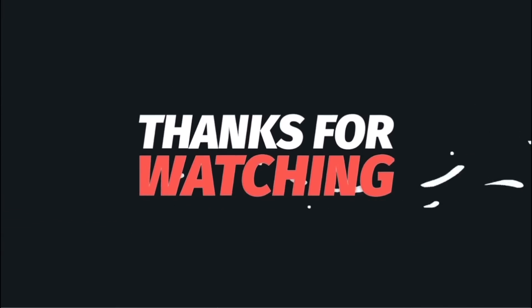Okay, so dirty filter on a 20-degree morning — that's all I found wrong. Thanks for watching guys. You don't always find something terribly wrong. Could be a case of them turning it off when they leave, coming in when it's 20 degrees in the morning and expecting it to be 75 within 15 minutes. We've all seen that before. I did advise them to leave it turned on and just turn it down. Subscribe if you haven't already and I'll catch you all in the next one.